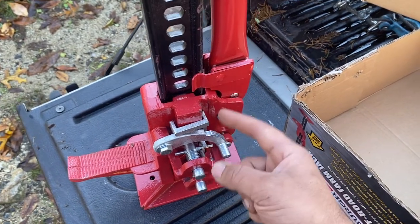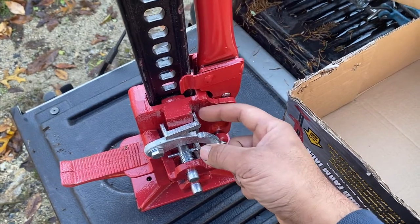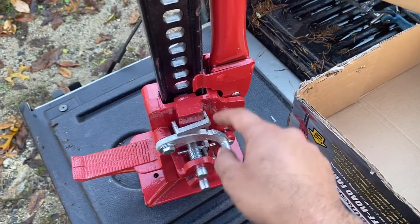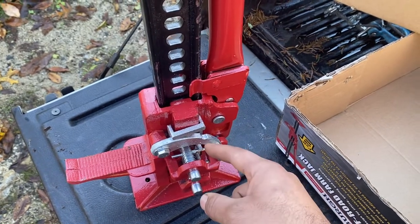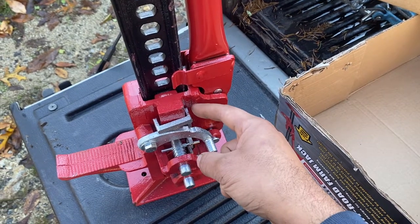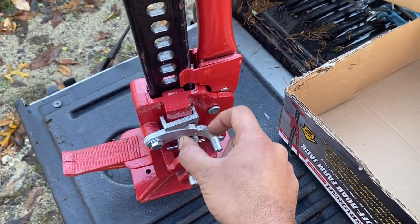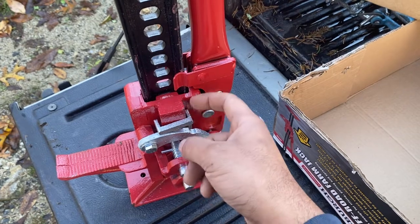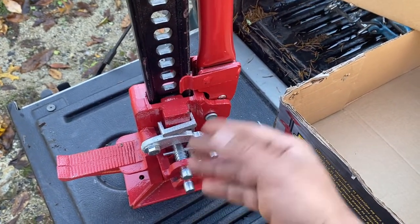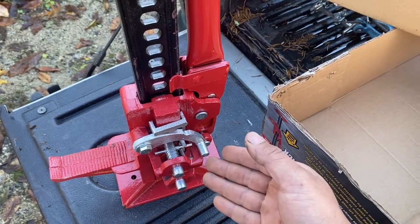The reason being that this little silver thing here wasn't falling down properly. Now, could I fix that? Yes. I could put some grease there and it'll work for a little bit of time. I could grease up the whole thing and it'll work okay for a while. Alternatively, I could take this piece off, grind it down smooth, grind off the bosses that it's riding on smooth, and make sure everything's nice and smooth, and then lubricate it, and it'll work even better.